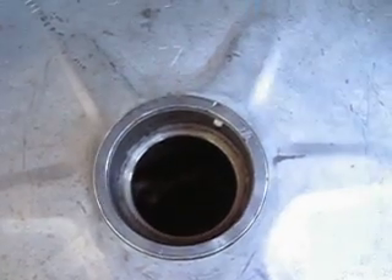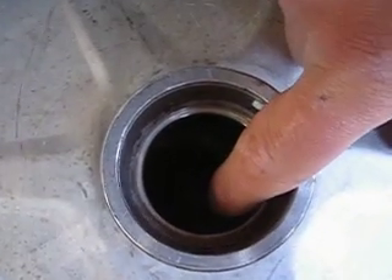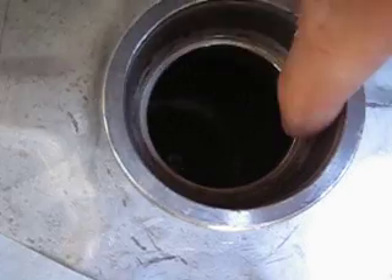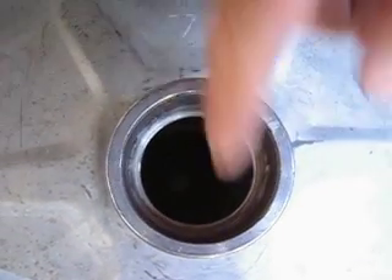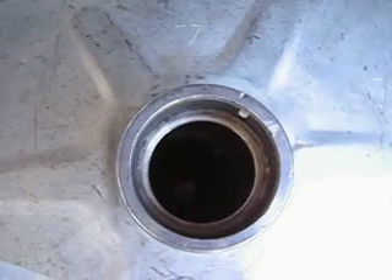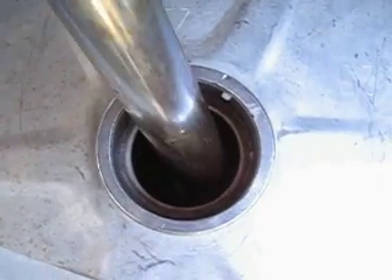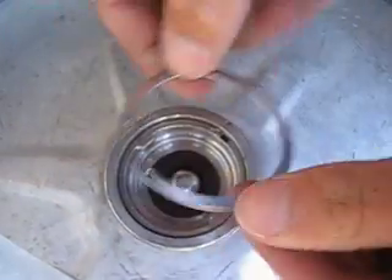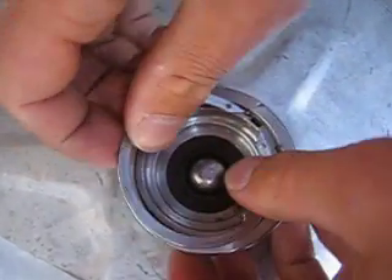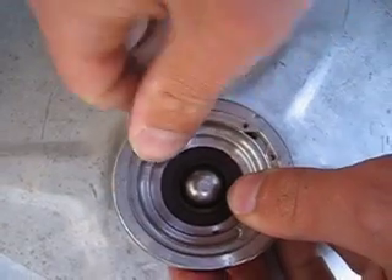Now that we've got that out, you can see we can pour our homebrew mix in there — a mash or whatever — pour that in there, and then sterilise it and clean it out, maybe wash it out with a high-pressure hose or something. For reassembly, we'll just put that back in and turn this anti-clockwise like that until it goes all the way down, and then replace the spring and this little clip in there.